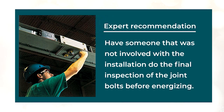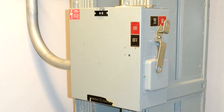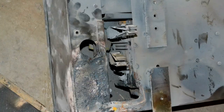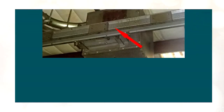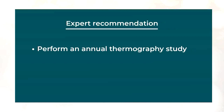This can be especially expensive if the damaged busway system is obsolete. My recommendation to contractors: have a person not assigned to the installation perform the final inspection of all joint bolts before the busway is energized. Another common failure is at locations where plug-in switches or tap boxes connect to the busway run. Most busway accessories are designed with spring pressure contacts, and spring tension can decrease if the metal gets too hot from a high resistance connection, usually resulting in a three-phase arcing fault. Here's an example of an overheating 800-amp busway tap box connection discovered through infrared thermography. Annual thermography is recommended for busway systems.